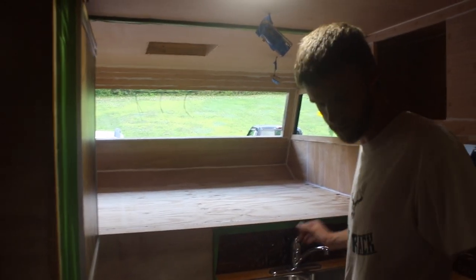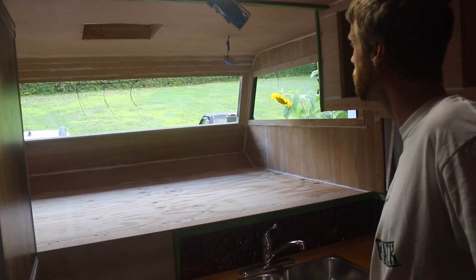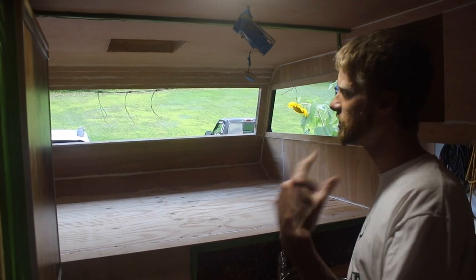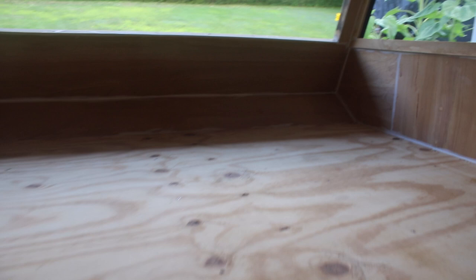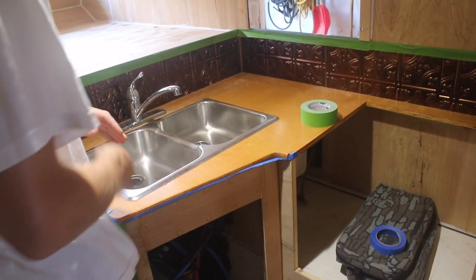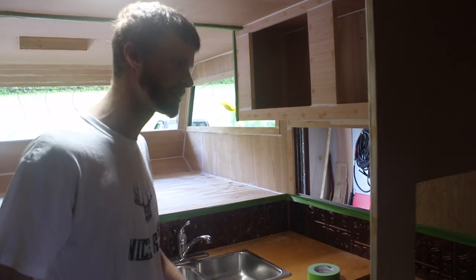Just a little update — we took a break and now we're back at it, working on the interior paint and mainly prepping for paint. We sanded everything down, got everything ready, then caulked all the seams — you can see the bunk area has a lot of seams. Right now we're taping everything off because we put the trim up first, so we have to tape around it. Hopefully today we get to paint the primer — that's the goal.